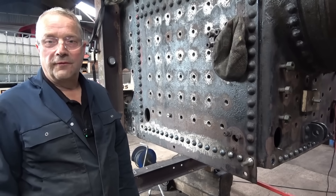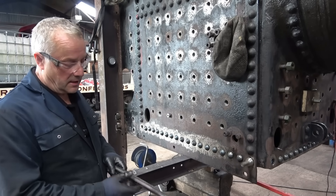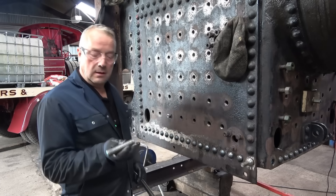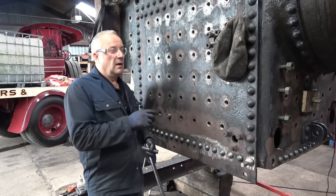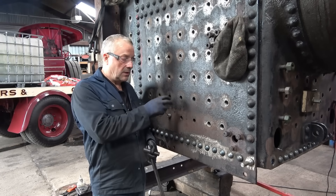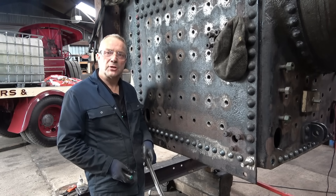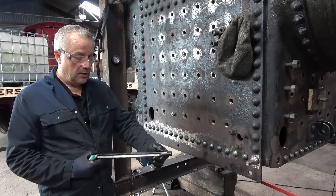We're going to get into proper old fashioned working now. This is the tap - 10 threads per inch. The next stage obviously is to put the stays in. I've got one here - in essence the threaded bar. But the thread has got to be continuous - it starts here and finishes on the inside. So I can't just put an ordinary tap in this side and then go and put it in the other side because the threads have got to be in mesh. So really you're putting a tap through the air gap between them as well. The tap's got to be a good long one. This tap will chance to be as old as the engine really. It's 10 TPI - normally it's 11 or 12. For stay taps I've actually got a range of them from 8, 9, 10, 11, 12. It actually starts off almost as a reamer for the first part of it, and then it goes into thread. So it's basically got to go right the way through and out the other side.